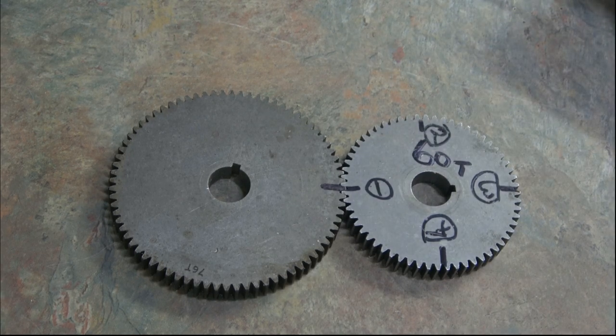So just make sure that when you're taking your depth of cut you've set it for a 16 TPI thread. Now you want to bear in mind that if you're cutting a metric thread on an imperial lathe or an imperial thread on a metric lathe, you must keep the nut engaged at all times, otherwise you'll get problems. The other thing is, although your lathe instructions may say you can drop it in on any number or any line when cutting a 4 TPI thread, I think to be on the safe side, whatever number you've engaged it on for cutting the first thread, just wait the extra few seconds for that number to come round again. They say you can drop it in, but if it goes wrong, of course you've got a lot of problems on your hands.